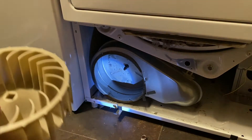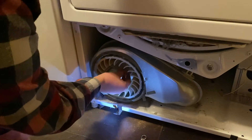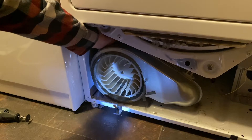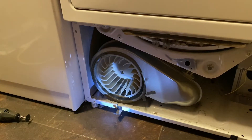The beauty of installing the fan is that you've got to put it on counterclockwise — it's got to get threaded on counterclockwise — and you should probably hold it with the wrench behind. It's a bit tricky to get it on that shaft, but it's still better than taking the whole thing apart. Get it on the shaft and just tighten it down finger tight — that's all you have to do. It's probably not what the first guy did, and that's why it was on so tight. Although as the fan runs it self-tightens, so it really doesn't have to be on very tight for it to stay tight.